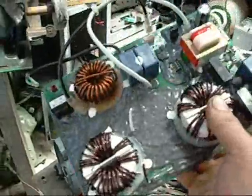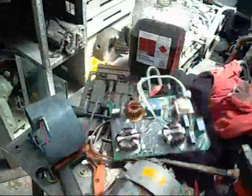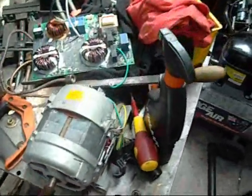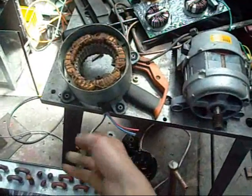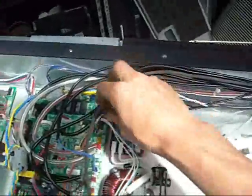I think this board here is for power management — it's got a CT on it, a current transformer, and also for RF filtering and noise suppression. Not useful around here. I know someone's going to pipe up and say 'you can't do that, it's an FCC violation, it makes RF noise.' Well, that's not going to stop me. I've got 240 going straight to the rectifier and straight to the board's own internal power supply — at least I think that's supposed to be 240 in. I'll soon find out if it goes bang.